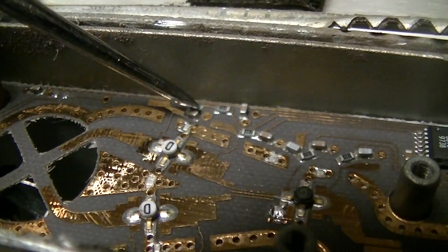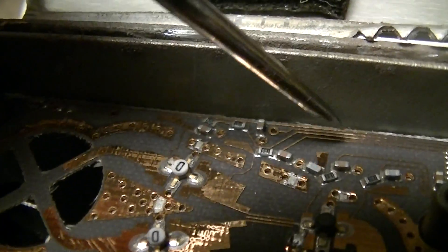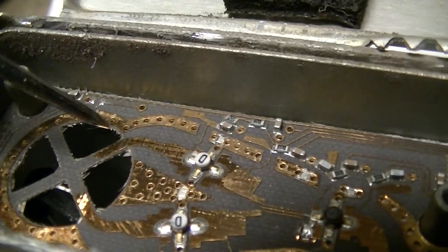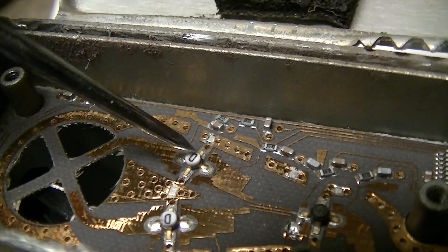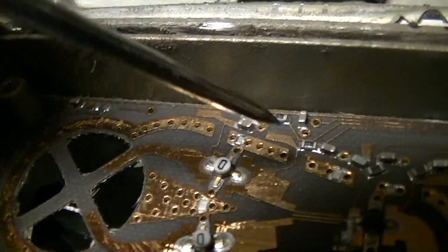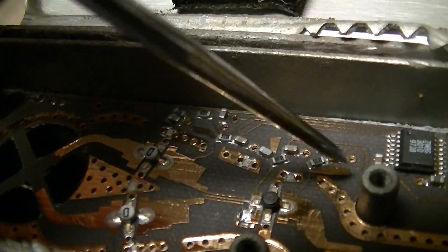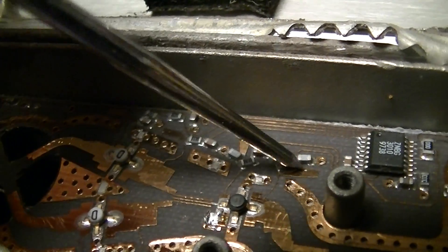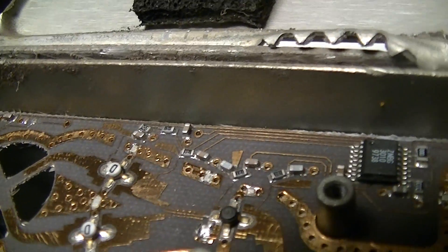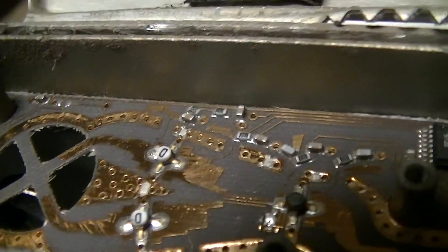You can see there's a bunch of components up here which are really just RLC passive filters, to keep any noise that these traces may pick up from RF bouncing around the side of the can out of the signal path, but also help keep crap out of the RF section. Very thin traces go to each one exiting the RF signal path, hooking up to one of these big pads, and there's also resistors and capacitors. The resistors provide loading, and the caps are just DC blocks or shunt any RF to ground.